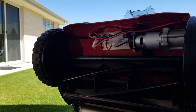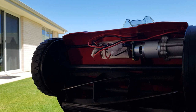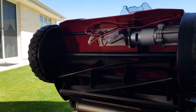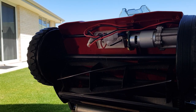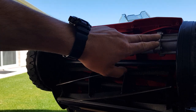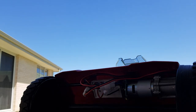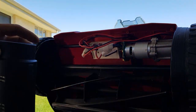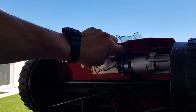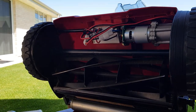It took me about 10 minutes to put the sides together - basically just screw back everything as you unscrew them. If you lay it in a nice order and put the parts aside, you can't stuff it up. When putting the cables in, try not to have cables over the motor here because there's not enough clearance between the black cover and the motor. Just try and fit them and push them back in as much as you need - you can let them be a bit bulky and then squeeze them with the cover.